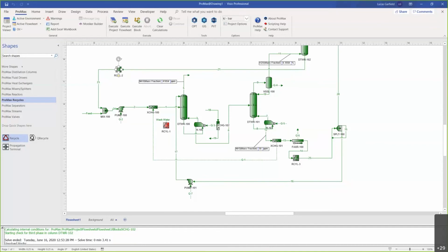So there's a question from Jelle. He's seen a unit with acidification of the first column and then caustic addition for the second column. You can absolutely model that in ProMax. The electrolytic package in ProMax is completely general, and the effect of any acid or base that you add in this system, whether it's caustic, whether it's phosphoric acid, whether it's HCN, whether it's phenol, whether it's mercaptans, will be captured and accurately simulated. And in terms of whether that's part of the Bechtel design or not, I'm actually not sure. I'm not an expert on what their specific current state-of-the-art version of this process is.